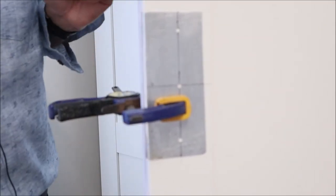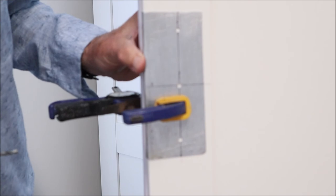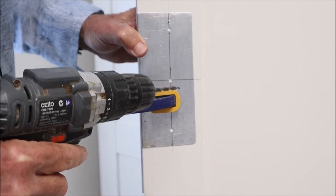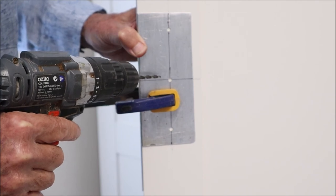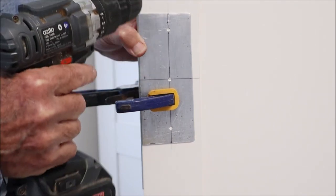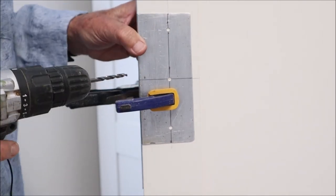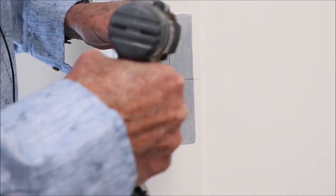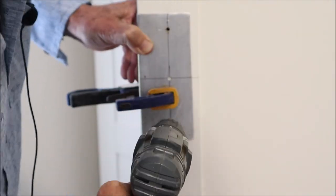Everything is clamped in place. I always put my finger here so it can't move when I'm drilling. Note: you don't drill the center hole obviously, but if you're putting on knobs instead of handles then you do drill that center hole, since knobs only have one bolt. So this template can be used for knobs as well as handles — keep the template because handles come in standard sizes and you may use this size again.